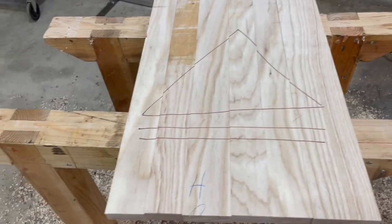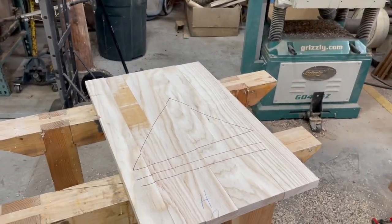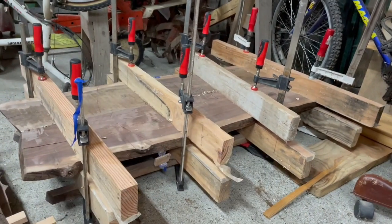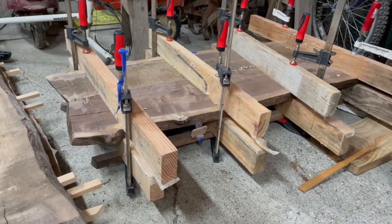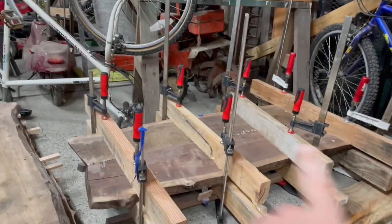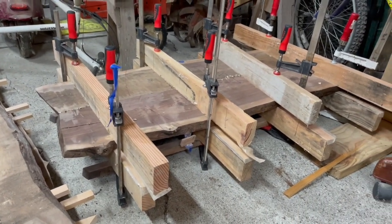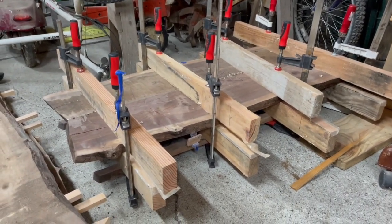If you wanted to get real fancy, you could get a little caul setup. Cut to a clip of the caul with the coffee table I have going right now. Here's the caul setup for this coffee table. It's not clamped horizontally anymore. I'm just leaving it in this caul setup to convince it to be flat. But that's what you do. You basically make a sandwich of these little caul dudes, clamp them down the whole way, and then you would have clamps running across the grain, pulling it together. But I'm running shy on clamps right now, and I'm probably going to pull these pretty soon too and hope that the tabletop just stays flat.